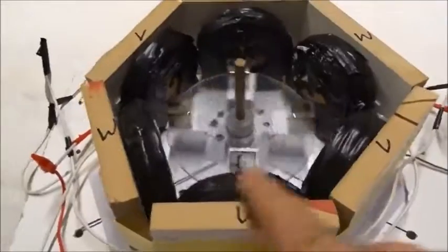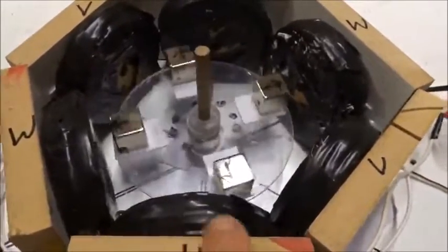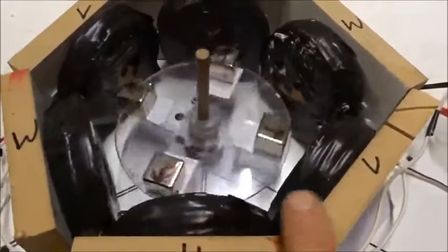3-phase power synchronous motor. Repeat, we've got 6 wire coils and 4 neo magnets arranged U, V, W all around. And what happens is, when a U magnet goes here and sticks, there's a big torque between V and W that pulls it sideways. So we have a sort of a synchronous motor combined with a linear motor.